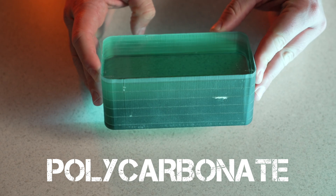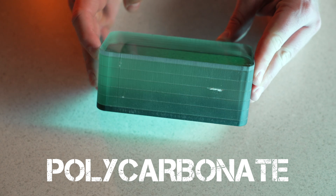But generally speaking, somewhere in your ballistic glass — in this case on the inside, the protected side of the glass — there's going to be a layer of polycarbonate. This is actually not glass; this is actually closer to a plastic or a Lexan type material, and that's your spall shield in your ballistic glass. There are also variants that are pure polycarbonate — you see that in a lot of lower level pistol rated type materials. But on the higher level rifle rated stuff, a lot of times at least the inside most layer is going to be a polycarbonate.